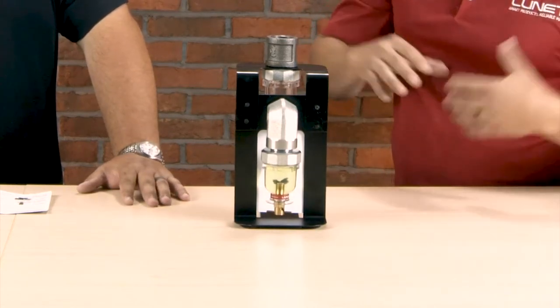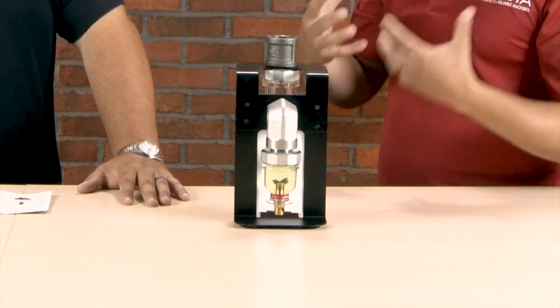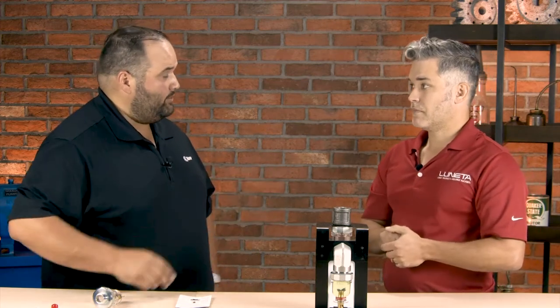That's why I like this demo unit, because it helps explain how powerful having a crystal clear 360-degree view is. During your daily inspections, it's very easy to see a change like having some ferrous debris collected on the magnet. The 360-degree view is a good feature too, because if it's a low-light situation, you could get a flashlight or a laser pointer, stick it up to the side of the bowl, and it'll illuminate it and tell you what's going on.